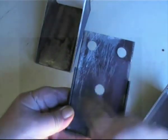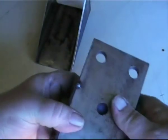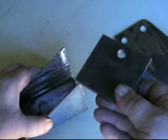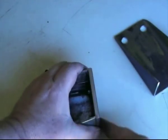The precise location of the half-inch holes is shown on this drawing. You can now proceed in drilling these two holes only in the small wedge. The third hole in the drilling jig is used to locate a drilling point in a backing plate for the large wedge.